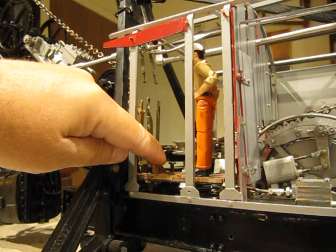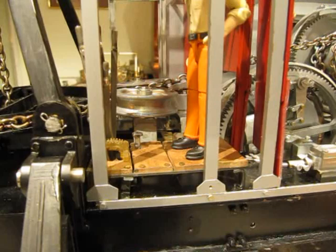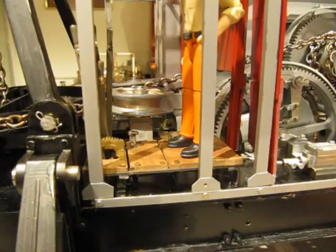On the floor here is a brake pedal for the hoist drum. The lever on the floor here engages the dog clutch, which engages the main hoist engine to the front tracks to move the machine forward and back.